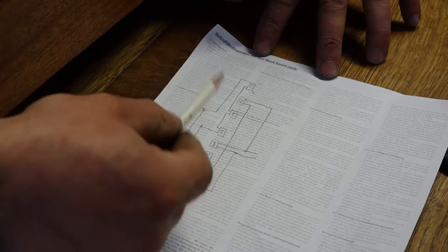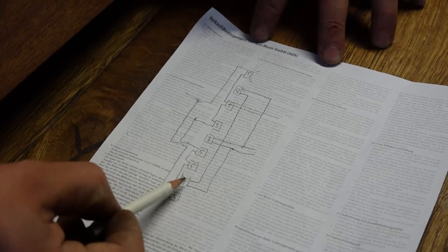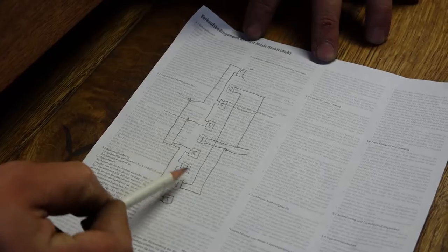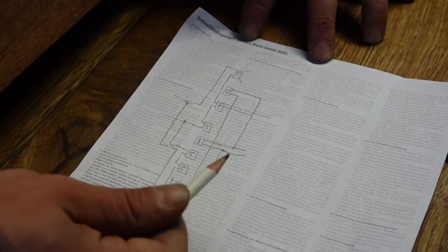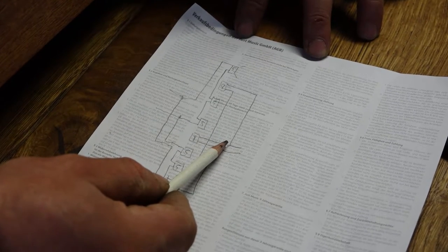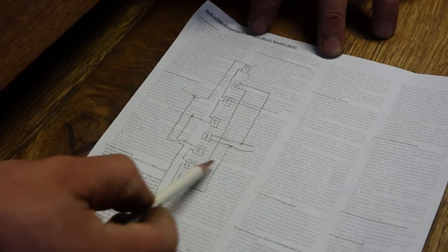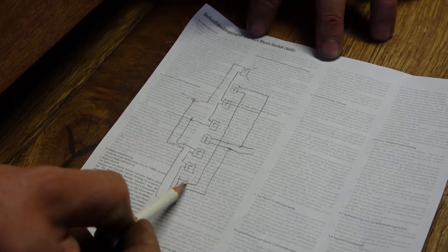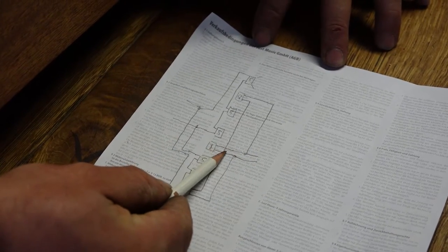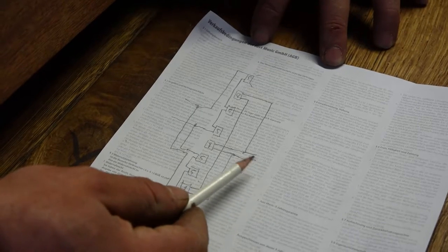Here is my plan for this really crazy speaker. 6 low mid drivers and 3 high frequency drivers. And the high frequency drivers are 8 ohm, but the low frequency drivers are 5 ohm. And to make something similar, I connected the 2 8 ohm in series, then it became 16 ohm, which is the high frequency speakers. But the middle one I connected in parallel with this 16 ohm. And as you see in the beginning, it's not actually 8 ohm, it's about 5.6 or something like this. And it means in the end here we will get about 9 ohm, 9.5, something like this.